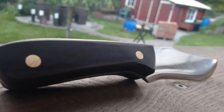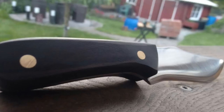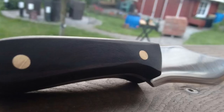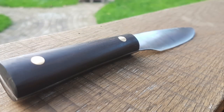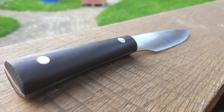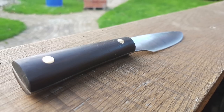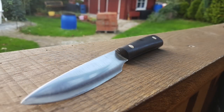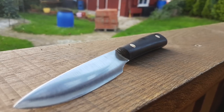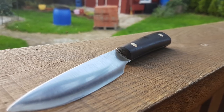These first knives are sent to me from Jason, a 16-year-old knife maker from northern Germany. He makes knives for his friends as a hobby while finishing up school. This first knife is a carving knife for a friend who likes the woods, and this other one is a drop point style made for his uncle who collects wild mushrooms. He used high carbon steel for both, with ebony wood scales and brass pins. He's collecting tools to get into forging blades but currently does stock removal. Great work, Jason — I'll put a link to his Instagram in the description below.